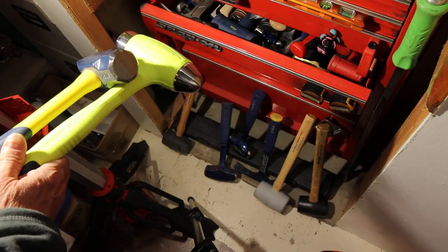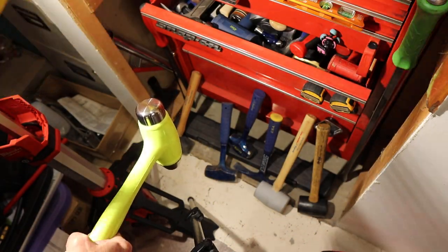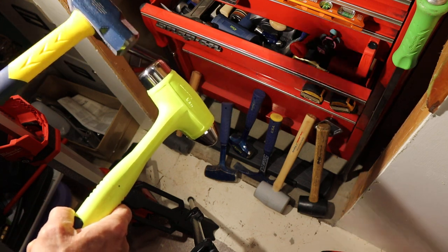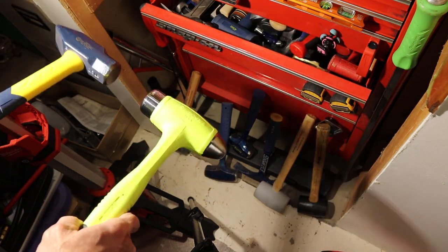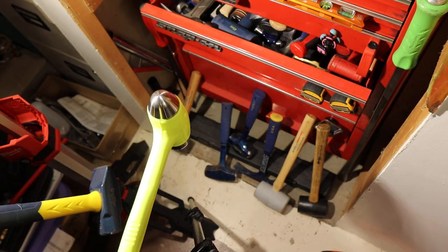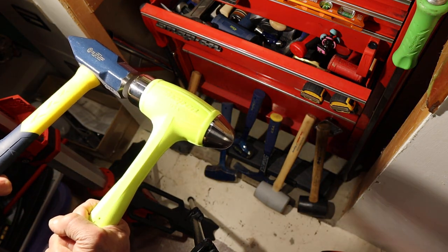And the reason, of course, is because you then can kind of conserve some of the energy by having the hammer bounce up off. So if this was my anvil, this is going to bounce up, whereas the anvil needs to be super hard and of a proper kind of metallurgy that causes a huge rebound. Because that takes a lot of the stress and the energy off of pounding on a chunk of metal all day, whereas the dead blow is designed to stop and to provide all of the force directly onto the striking surface and not necessarily bounce off at all. So these are two wildly different kinds of hammers.